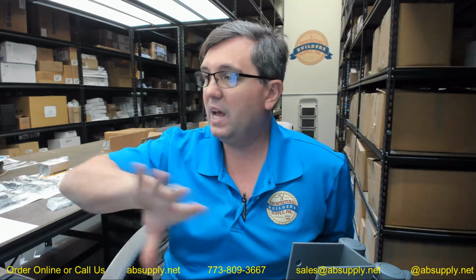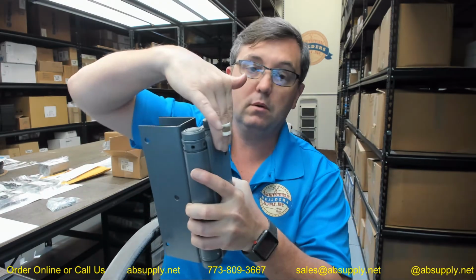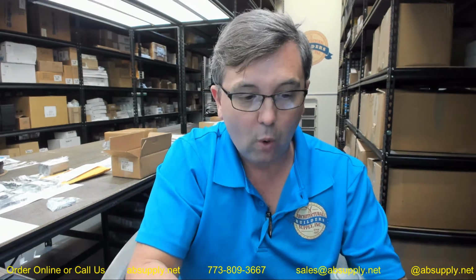What's really important to talk about is the table and graphic in the upper left-hand corner. Pardon me, upper right-hand corner. What they're showing us here is, what the heck is my door size going to be? Okay, so you're going to install this hinge. This hinge is giving you definite dimensions from the jamb to where the door is going to be, and ultimately from the jamb to where the door is going to end. That requires some thinking and planning, okay?